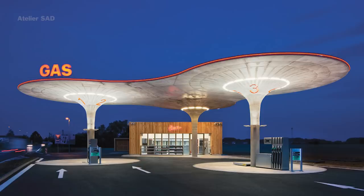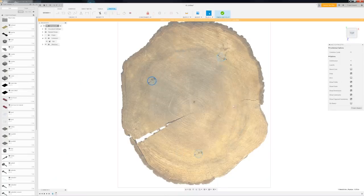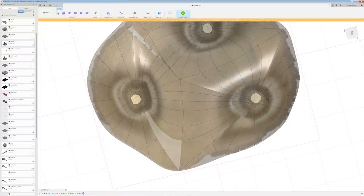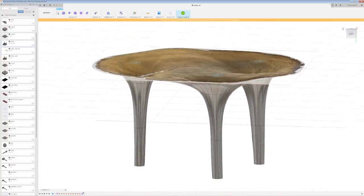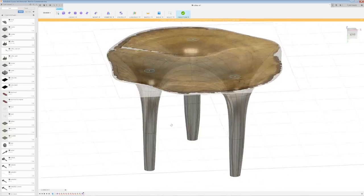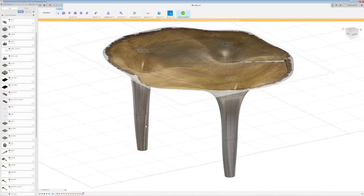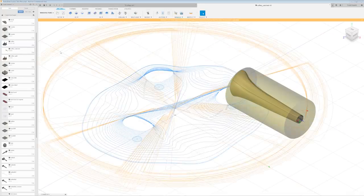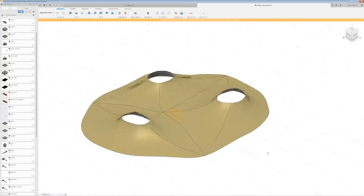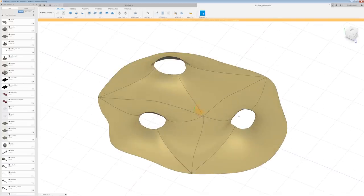I had seen a photo of a gas station a few years ago that kind of inspired the design. I really wanted the legs to be columns that came up and flared out and received the underside of the table — so the legs almost drip down from the table. This is the model to run on the CNC. I sliced off the legs and had a table section to run on the cross-section of the tree, and three leg sections to run on the fourth axis.